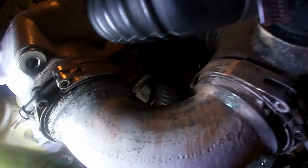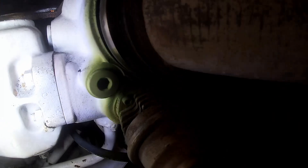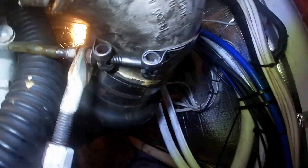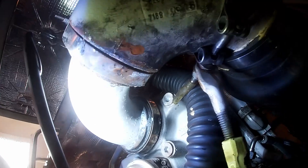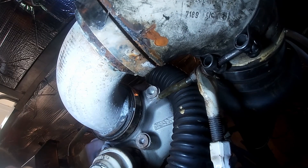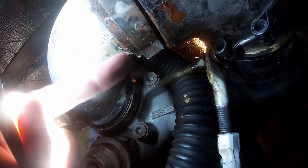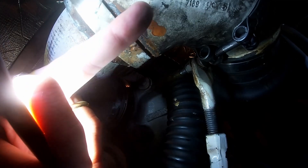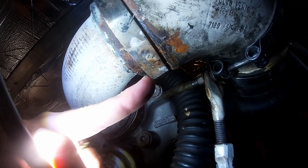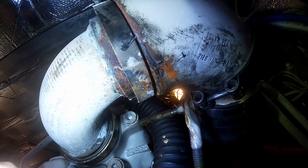With the insulation removed from this elbow, what we see is here we've got a V-band clamp from the turbo that looks nice and pristine, and we have this V-band clamp going into the exhaust elbow. We may have a leaky clamp right here, or we may have an issue with the casting. The next step might be to remove this and see what's going on, or maybe to clean this up and run it to see where we're actually leaking from — the clamp faces or the casting itself. You can't really tell right there.